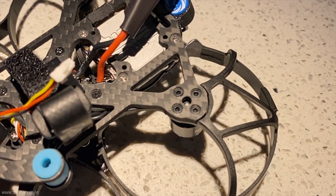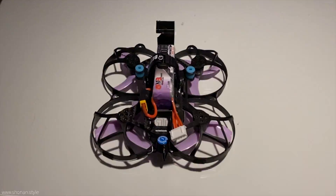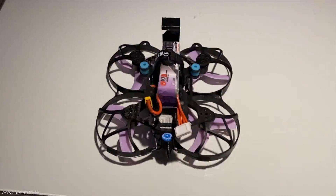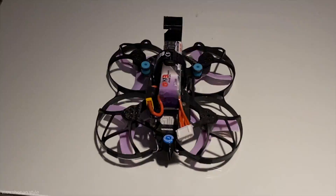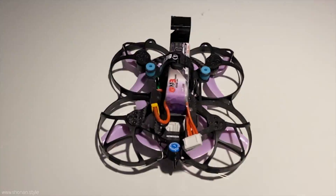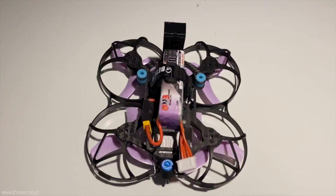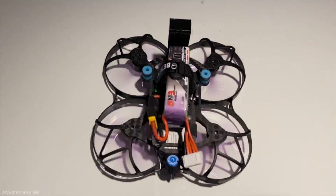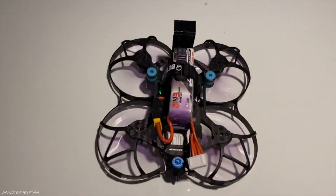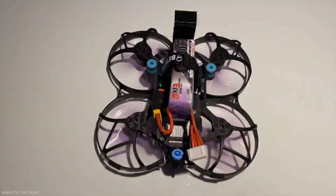After reassembling everything I made sure that the engines are running in the right direction — and they did. And I also made sure that the props are on in the right way — and they were. However, when I went for a test flight I got an insta-flip on throttle up. That was quite disturbing since I had no idea in that second what happened and why the drone flipped. But then I remembered that I had flashed the firmware and updated everything. So since the flight controller of the Beta 95X is flipped, the flight controller might not remember the correct location where the engines really are.